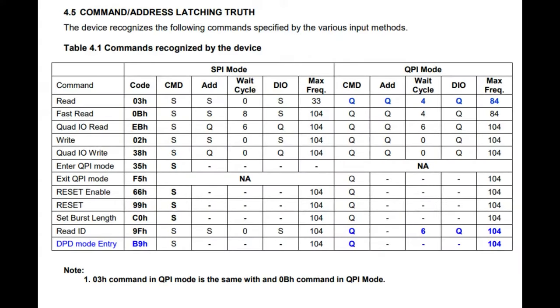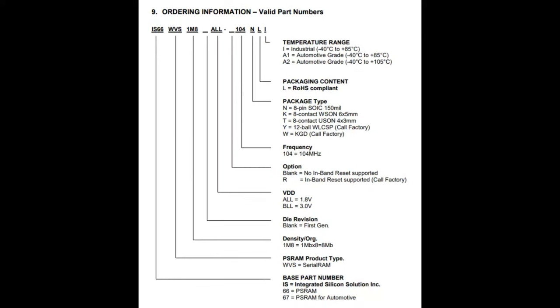You will need to tell your compiler or toolchain that PSRAM is attached to these pins, and you may need to specify the command names for quad IO read and write, or to put it into quad mode. Sometimes the bit to set quad mode is in a certain location — you can see it says 'enter QSPI mode' — and that varies from chip to chip. So don't be surprised if the chip doesn't immediately work; you may need to change a setting in the makefile. Good news is that ISSI is very popular and a very prolific maker of memory, so if you have a chip that supports PSRAM, there's probably already a configuration file for ISSI.